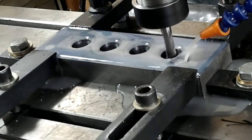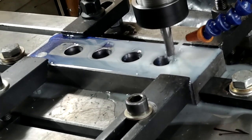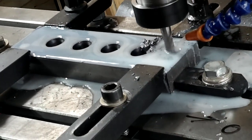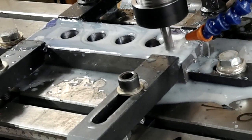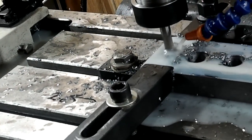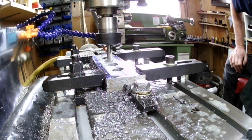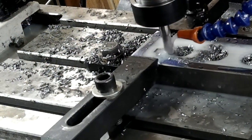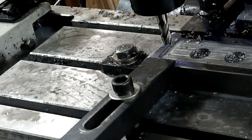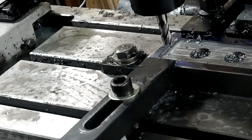It's decision time for the recess face depth. I was thinking initially of going to a depth of 7.5mm on both sides to leave a 10mm thick section in the centre, but I decided to make the recess a shallow one at only 2.5mm deep instead. My reason being that removing too much material is likely to create stress in the remaining material — besides that it's less work and my cutter will probably last a bit longer too. I know these clamps were being used the wrong way round but there are enough of them not to cause any real issues; I needed primarily to keep the clamps well away from the cutter. That's the recess face done — it's a bit tatty because the cutter's not very good, but it'll do.